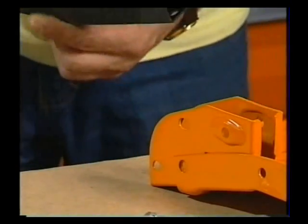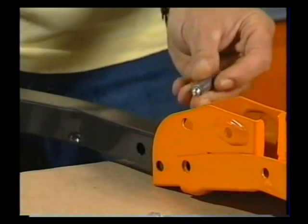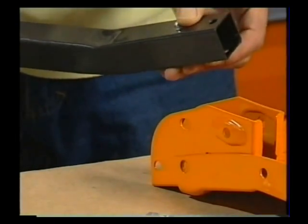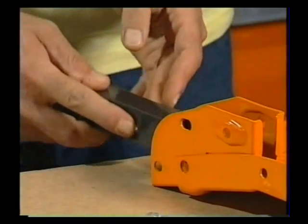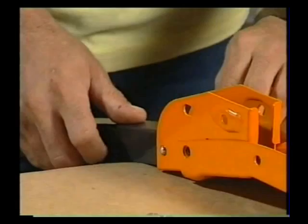So have the leg in the correct orientation, facing outwards away from the work centre, then take the leg lock pin with a spring-loaded ball, feed it from the inside of the leg through the second hole, and make sure the barrel is sitting neatly between the two holes, just like this. A little bit fiddly, but then by holding the pin in with your finger, you can slip it into the leg bracket and it should pop through the hole like that.